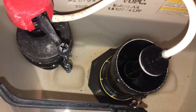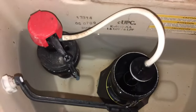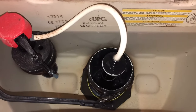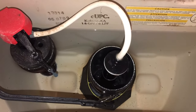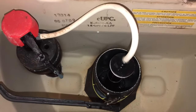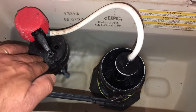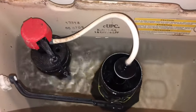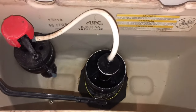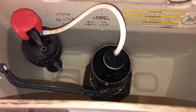That yellow seal down there looks like this. What's happening with this toilet tank — the issue is that seal is failing, and so what happens is the water level slowly drops in the tank to a point where this thing will drop far enough and you'll hear it kick on. You'll hear that toilet tank filling randomly. Now this can waste water, so it should be replaced.